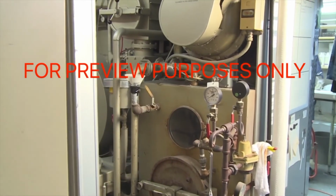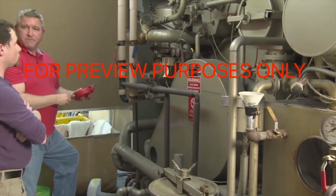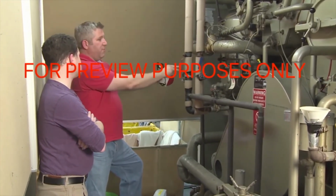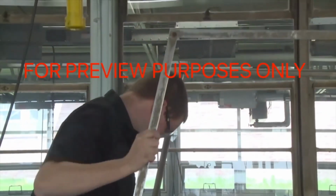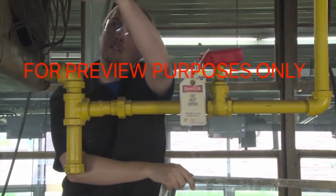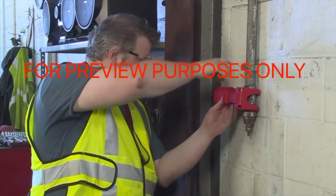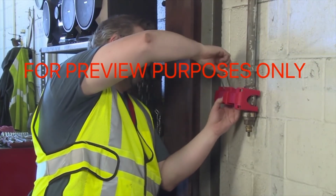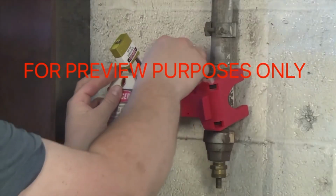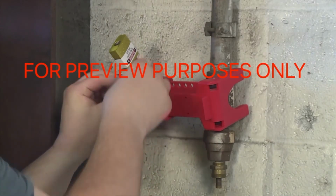Performing lockout-tagout on hydraulic and pneumatic equipment is different than doing it on electrical machinery. With these types of systems, lockout-tagout usually involves pipes and valves. In these situations, the hazard is the potential high-pressure release of steam, gas, hydraulic fluid, or other liquids. To lock out these systems, you typically need to use a padlock and chain or some type of valve clamp to make sure that the valves can't be turned. Once these devices are in place, you can install the tag.